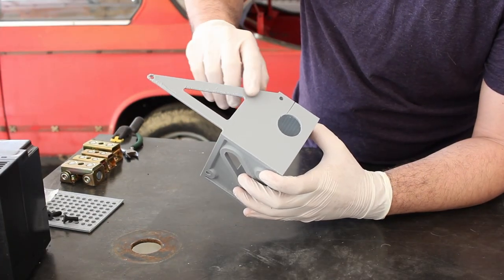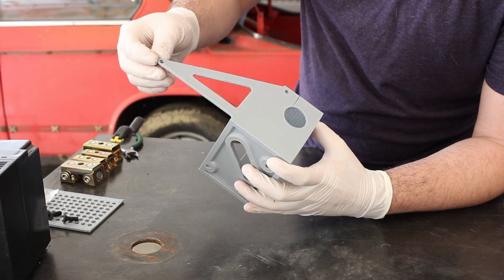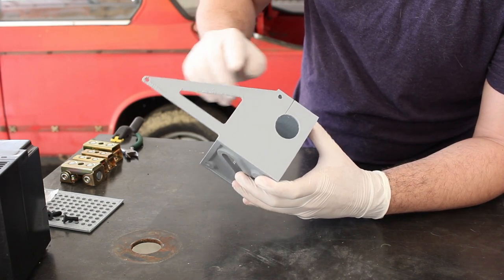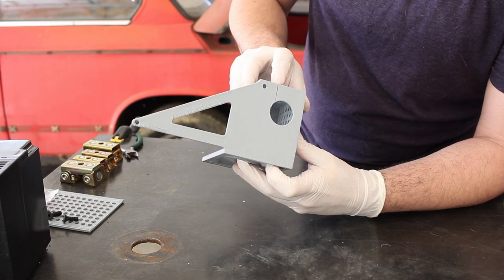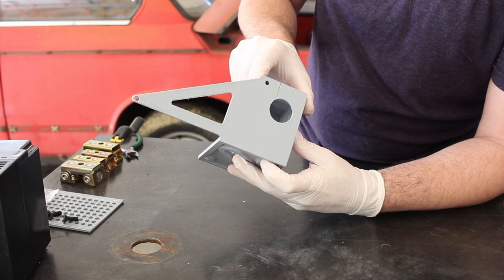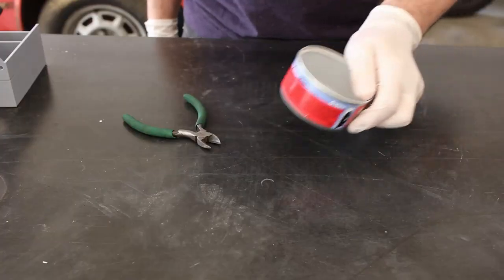We'll have to deal with this roughness and over-extrusion, and I'm not happy with how thin this edge got, but I think it'll work just fine for our purposes. We do have a little bit of delamination to fix as well, but a bit of ASA slurry should take care of that in a hurry.